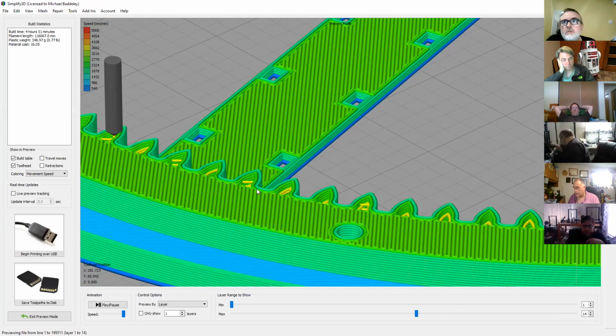And what states the filament at that point then? Is it nozzle jammed? Yep. So it's not feeding the filament. No, and then the weird thing is when I turn the machine up, if I preheat the nozzle and just give it a little poke and a shove, it'll go ahead and out the end of the nozzle. Huh.